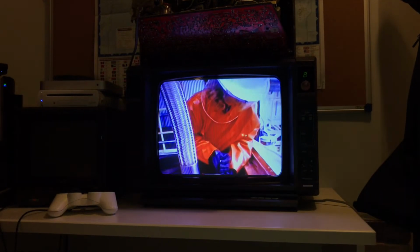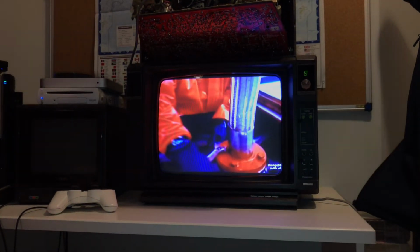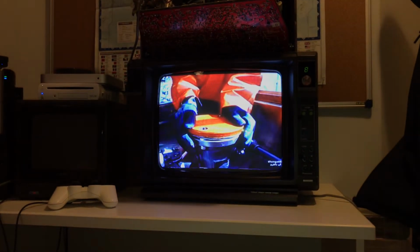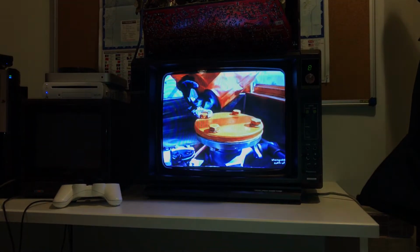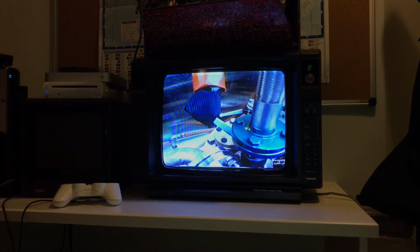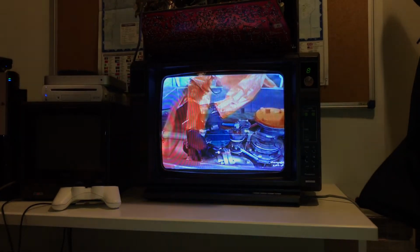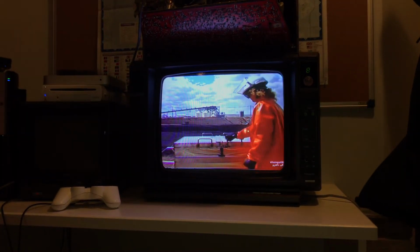Unhooking the truck is a careful reversal of the loading routine, beginning with the closing of the fill valve, followed by disconnecting the loading arm. The loading arm is pulled free and pushed back into its parked position. When the arm is parked, the driver bolts the orange flange back onto the orange loading valve and tightens down the flange bolts. The driver now moves to the green valve and closes off the air, unhooks the flange and hose, replaces the green blind flange, and tightens down the flange bolts. After carefully stowing hoses and checking for leaks, the driver closes and tightens down the dome.